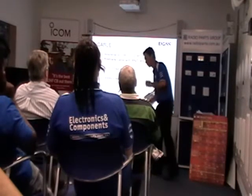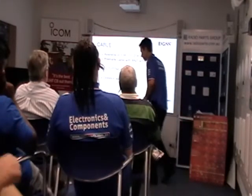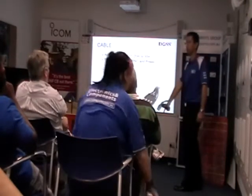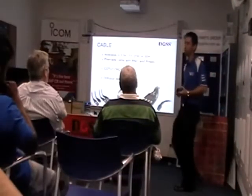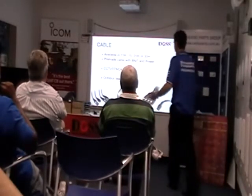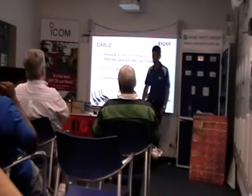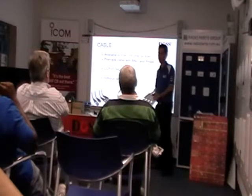I've just basically chucked in some accessories. We've got the extension leads, available in 10, 15, 20, and 30 metres. We only go up to 30 metres with these because they are not as good as running RG59 cable, but in a domestic situation or something like that they're good for ease. They're already pre-made, with the BNC pre-molded on it along with the power. So you can simply use that as well, as long as you run the cable around the correct way.